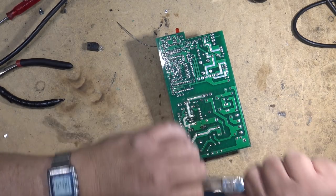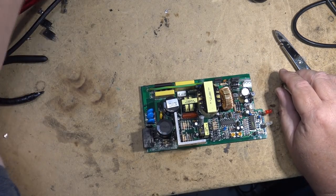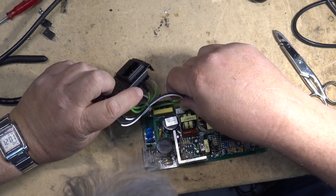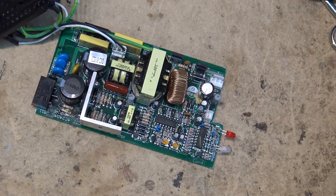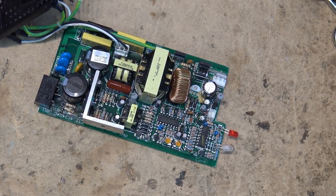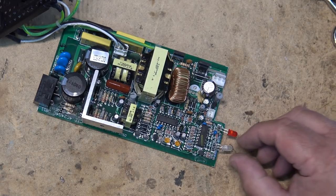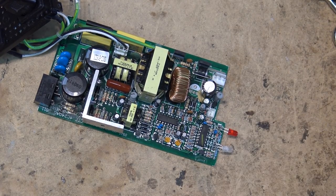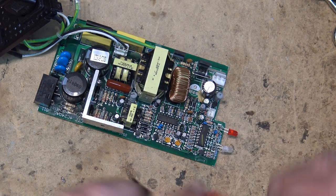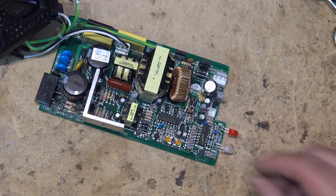When I power this up I'm going to use my dim bulb tester to apply power. That way if something goes wrong we won't have fireworks. I've got the unit plugged into the dim bulb tester. We'll turn it on. Hopefully we'll see some light. If it comes on — no shorts at this point. I don't see any light, so maybe there's more wrong with it than this. It may have blown the oscillator circuit, because we should have power. I've got 130 volts but I don't see any lights on this thing — it is not working.